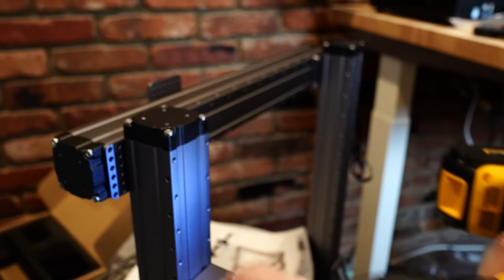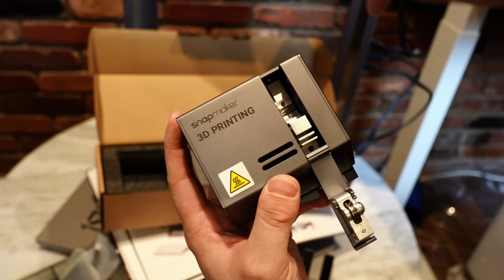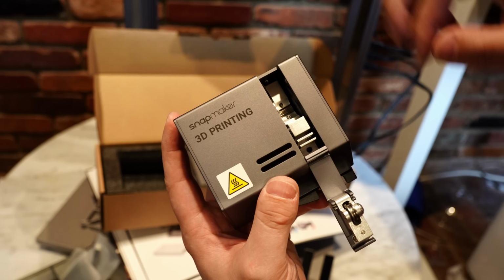That's an extremely small spur gear, so that means it should drive the filament with a pretty high gear reduction just from that gear being so small. However, when you have a low tooth count gear, you end up with more issues with cogging. Generally, you don't want to go below 10 teeth on a gear, because imagine you have a gear with like 4, it's not going to be able to drive anything smoothly.